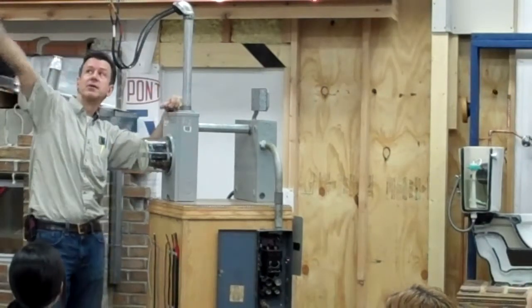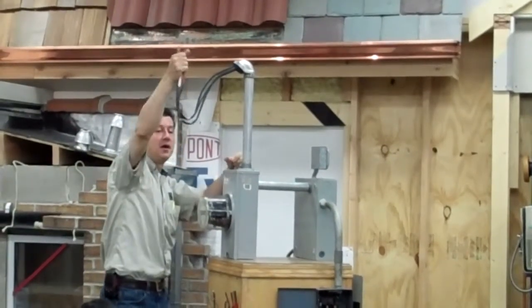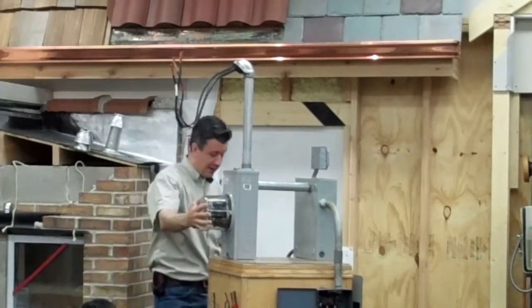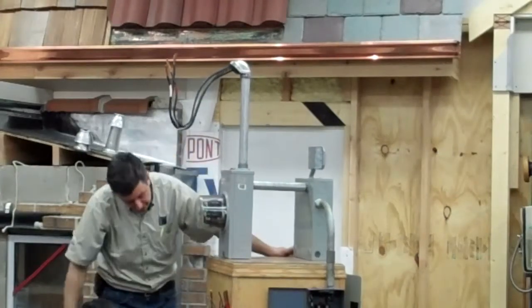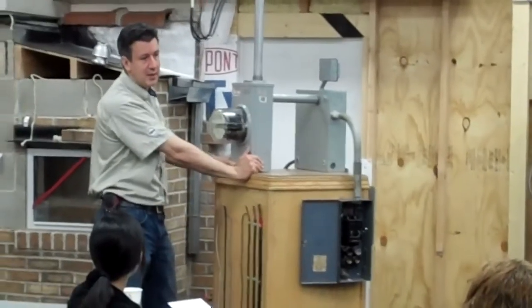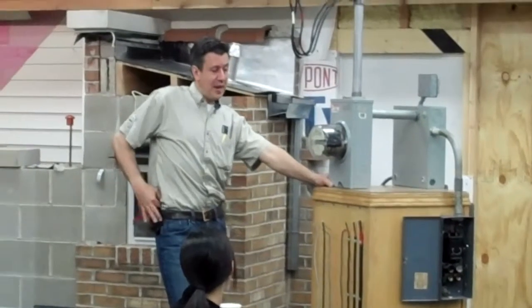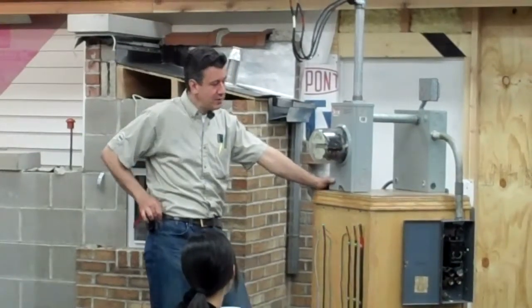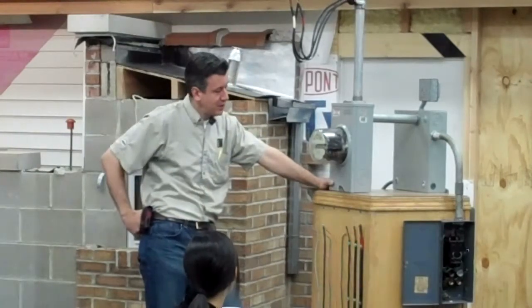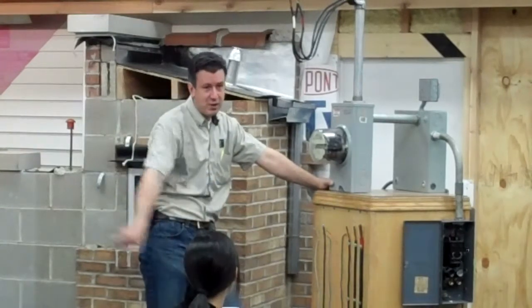And then you usually have your electric service coming in, and there's a clamp that's bracketing that service wire to the house, and then you have your connections over here for your good service. This one doesn't have an example of it, but we also want to have the grounding rod now. There's a pipe that extends down there. Copper pipe is hammered down into the ground, typically about 8 feet down. And if the system has a current running, you have natural ground that is sending that current and dissipating it into the soil.